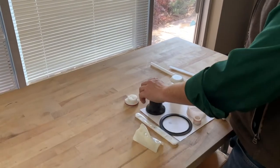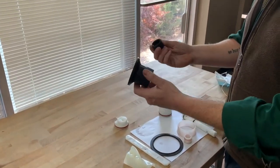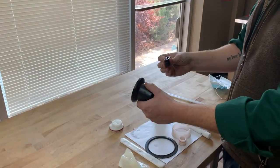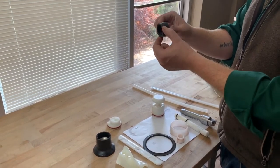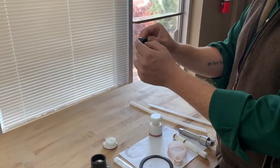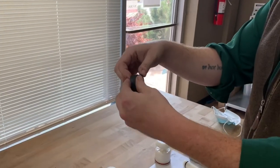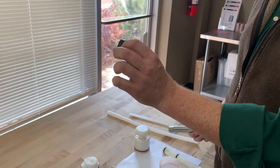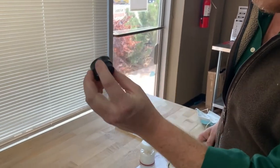So the other two things is that your rear seal. So your rear seal is what stops product from leaking down into your machine and then hurting your investment. On Taylor, most of their machines use a version of this O-ring. Kind of has a bit of a donut, and then it has a bit of a concave. It's always important that this concave is out and not in, because if the employee flips it inside out, it won't actually keep the machine without having product falling down. So you want to make sure that, you know, it's this one you can tell is getting old.